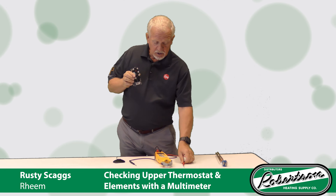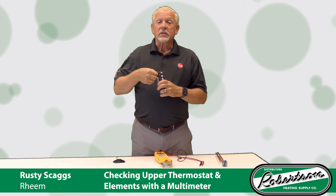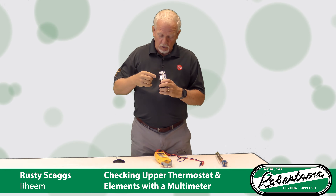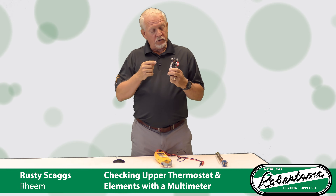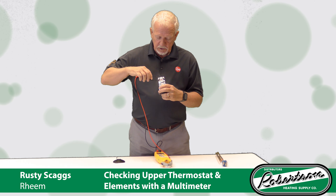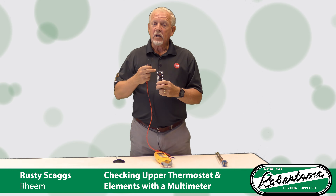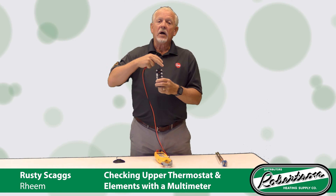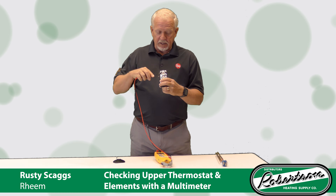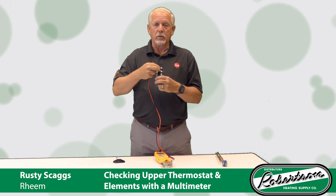To test this ECO, take your multimeter. There are two ways to do this. Without power first: turn your power off to your water heater, make sure you've got no 240 volts going to the heater, then disconnect your wires. Set your multimeter to continuity, take your two probes and touch one side. If it beeps, that's telling you that leg is good on the ECO. Remember, this is 240 volts — you've got a 120-volt leg here and a 120-volt leg here, which combined give you 240 volts. After you've tested that side, test your other leg. If you get the beep, you know you've got a good ECO with continuity through both sides.